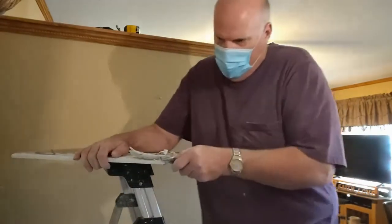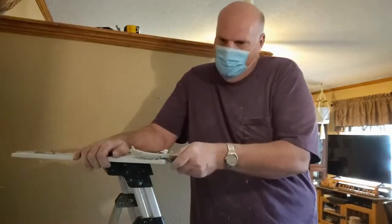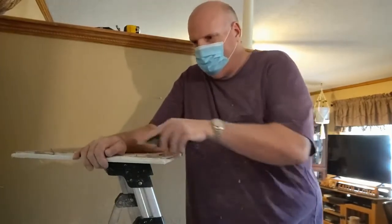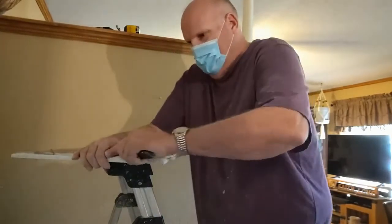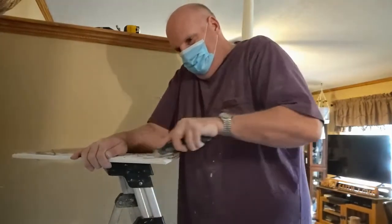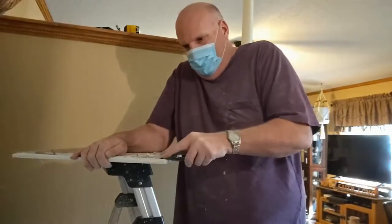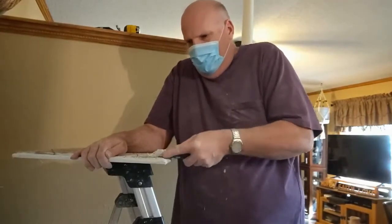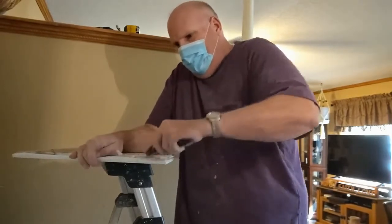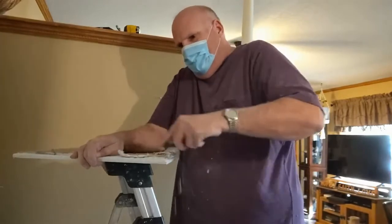So you've got to be patient with this stuff. You just do a little bit at a time. Eventually, you'll be able to remove enough to float your drywall up into that uneven area.